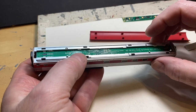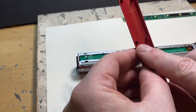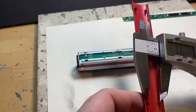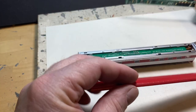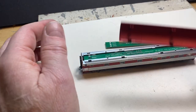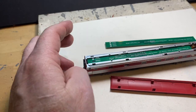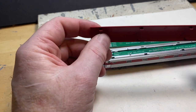We filed the inside part, but I had to take the roof off to make this fit. I noticed that the tabs that hold the roof on are smaller than 11 and a half millimeters — it's about ten and a half. So I'm going to look at the board and find places where we can carve into it so the roof slots will go back in. It's amazing — we've done hundreds of installs with different manufacturers and always come across something funny like this. I don't want to cut these tabs, so we're going to cut the board instead.